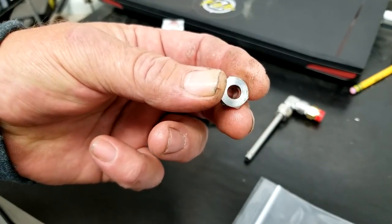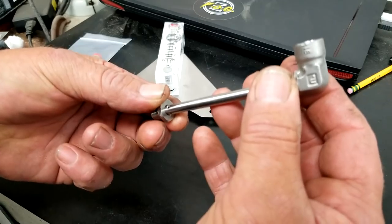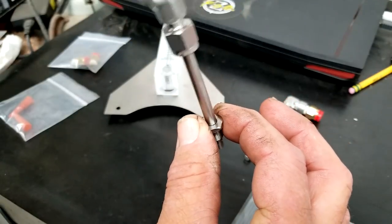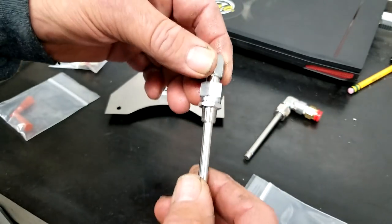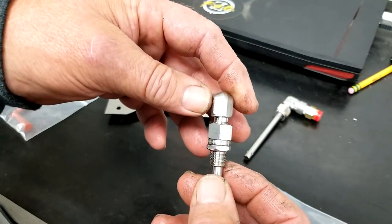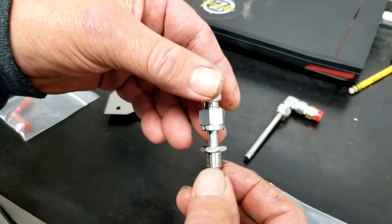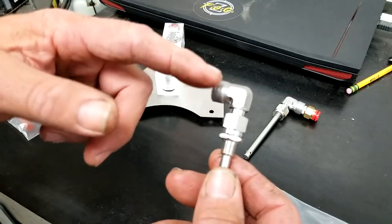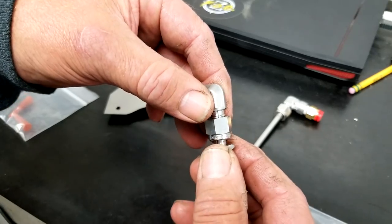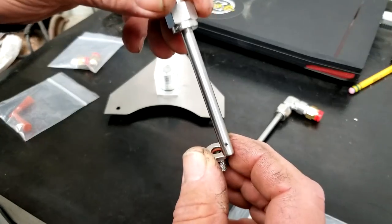The ports are about a quarter inch off the ceiling of the oven. You still need to drill and tap. I made a little bushing from eighth-inch pipe plugs with a hole drilled in them and a high-temperature o-ring inside — it creates a friction fit so the argon tube stays wherever you put it. I do have concerns about the o-ring; they're rated for 450 degrees, but this tube is way on the outer skin where we're seeing about 200 degrees. And since we're passing gas through here, it actually cools the whole unit. I made it a slip fit so anytime you're not using gas you can simply pull it out.